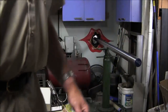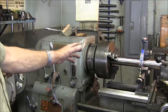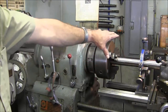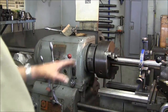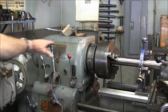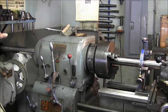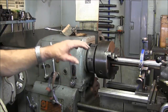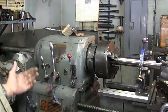Now that it's through, I move my carriage back, move the gantry back to get room, then snug up the chuck jaws. I adjust the roller after pulling the rag out so that I'm centered with the bore of the back of the spindle. The chuck will be running through. I'll squirt a little oil on the Delrin pad on the foot supporting it on the other side, and then we should be able to start machining.